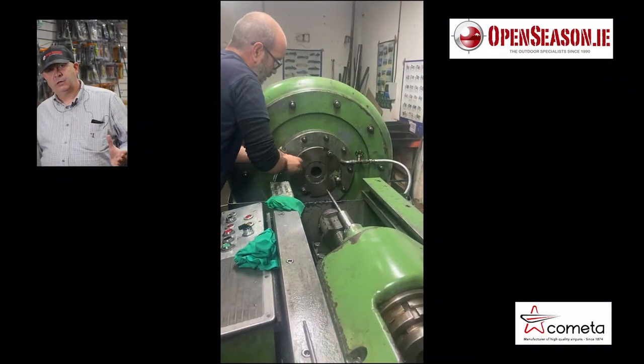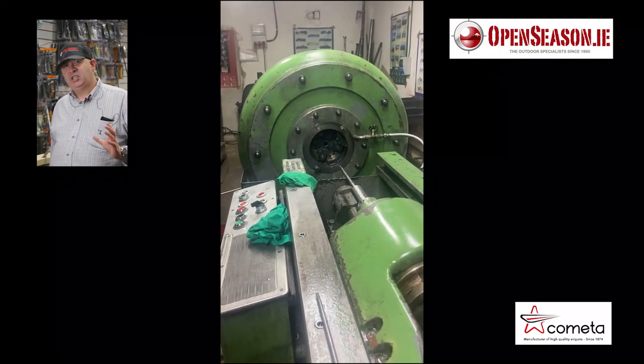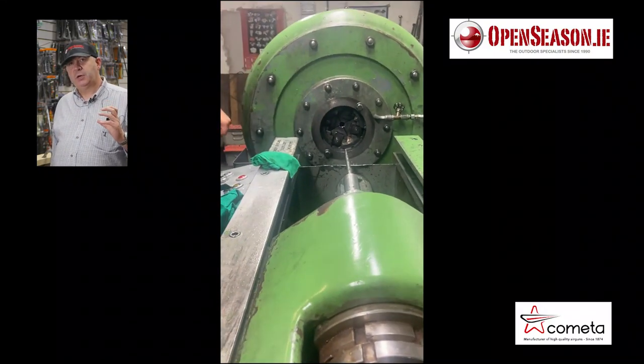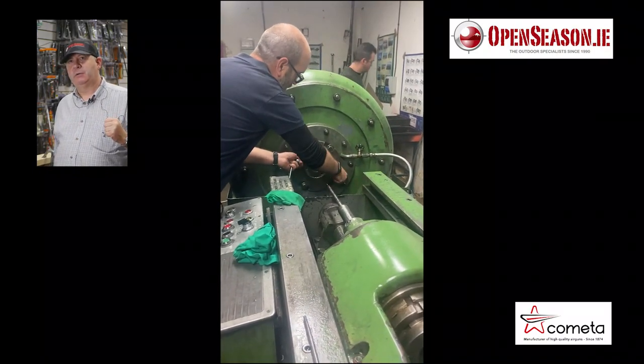So how our barrels really become rifled is in a special rifling machine, which was originally made in Germany. So the process is called cold hammering. And here, the technician in the factory, who operates the machine, he actually shows us the hammers. They're essentially just big hammers inside a machine, and they operate at huge pressure. And we're going to show you then how they actually rifle the barrel in a minute.